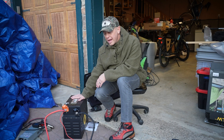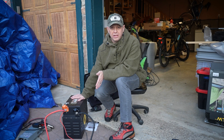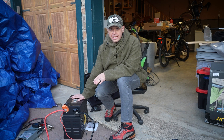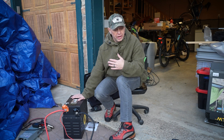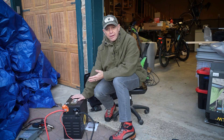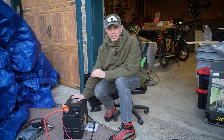There's a heating element inside of this that will warm up the battery above about 51 degrees when it gets too cold, in order to give it the ability to charge. That's amazing because this system is going to go into an overlanding trailer where it's going to get cold, and I don't want to be charging and ruining a battery. The solar panel energy that goes into the battery will turn on the heating element and warm it up so then it can start charging. This is a nice protection to have.